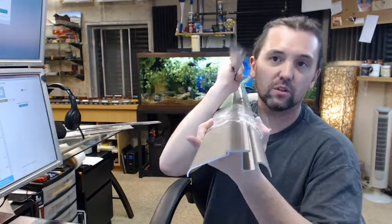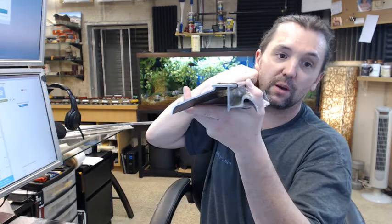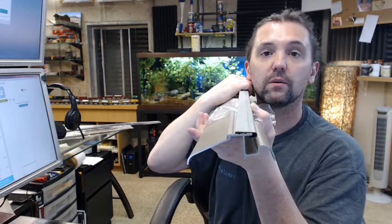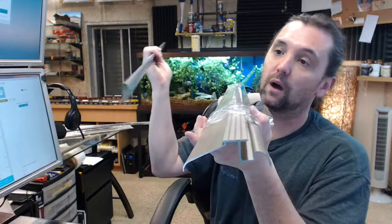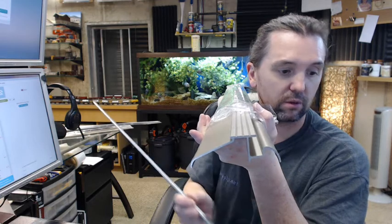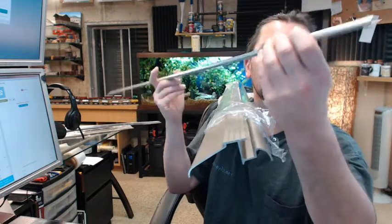So the J hook, it's a J because of its shape, if you use your imagination, is nailed to the bottom of the door. That communicates to this lip here. And when the door is closed, you can see it provides an extremely effective barrier to sealing the bottom of the door. It's a mechanical interlock. It couldn't be really much better. Very effective, known to last for a very, very long time. With an aluminum threshold, you'll get steel, definitely steel. It's a wipe coat galvanized finish on the steel.